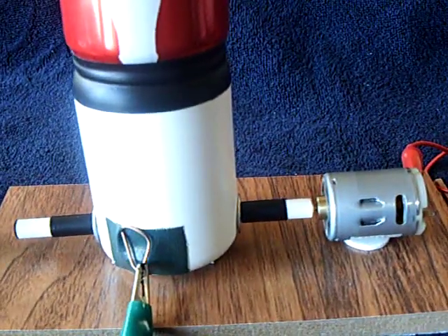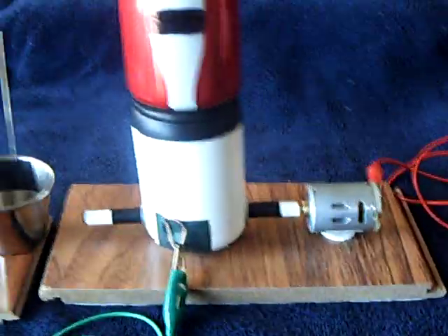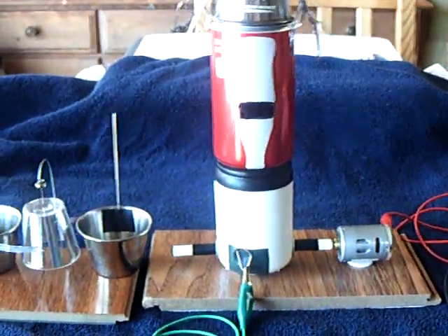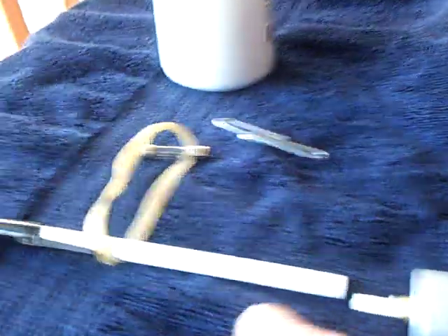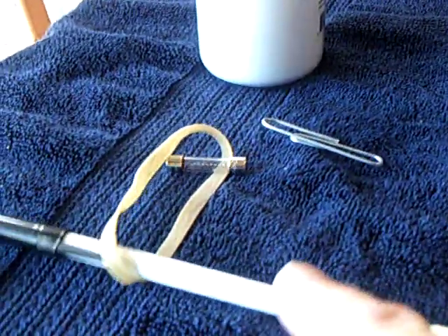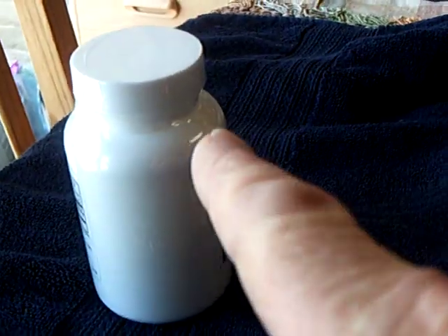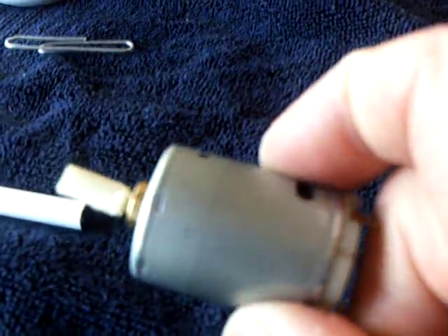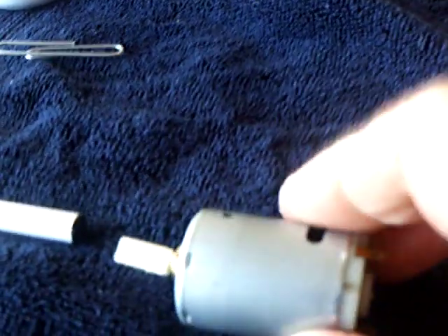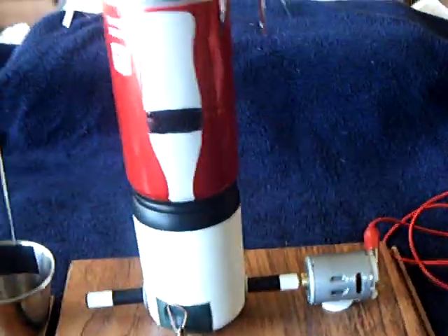Initially I was just running this by hand and it worked kind of nice, and I thought I'd put a motor on it. It worked out so well I thought I'd do a video on it. It's actually pretty impressive considering what it's made out of — just one of these plastic PVC stick pins, a rubber band, a fuse with the guts taken out, a paper clip through it, built up inside a pill bottle, with some tape wrapped around the end of a 12-volt motor stuck into the pin. And presto, you have a Van de Graaff generator.